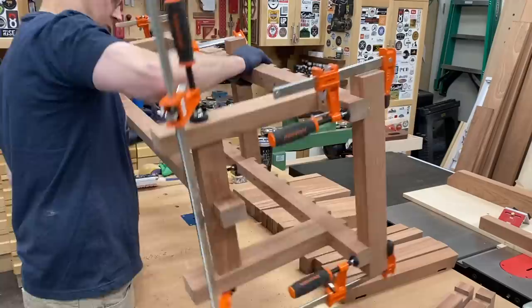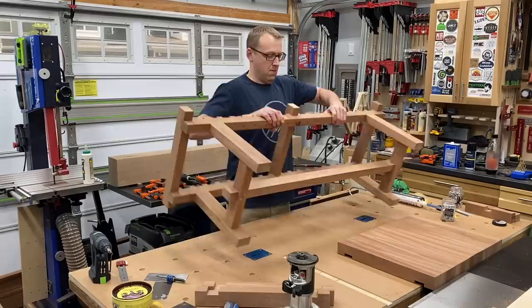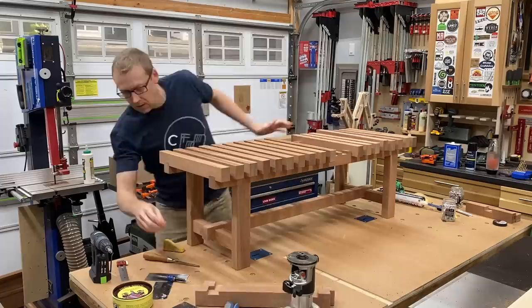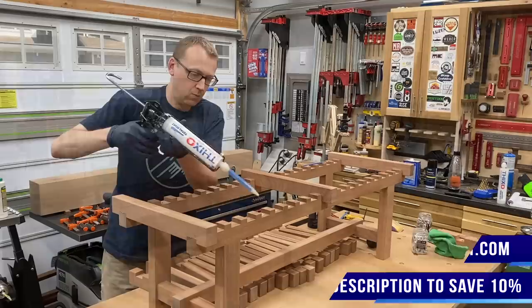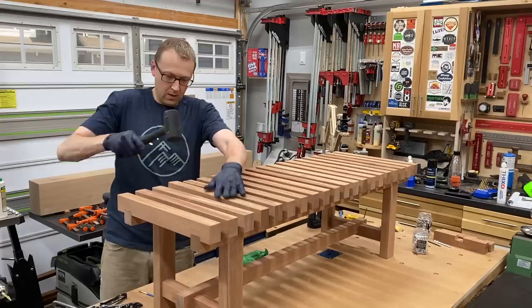Stage one was to glue and screw the end slats and the middle slat to lock everything into position, let that dry a bit, then come back and screw in all the remaining slats. With the glue dry enough I released it from the clamps, unflipped it off its back, and started laying in each individual slat and prepping them for pre-drilling. It had to be re-flipped onto its back for pre-drilling, and while watching a little TV Lola stopped in for a visit. Then it was Thixo time — applying epoxy on all the little dadoes and working my way down.